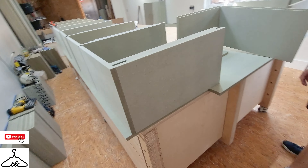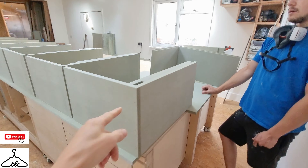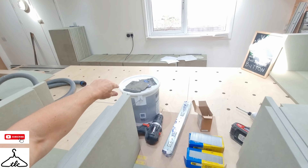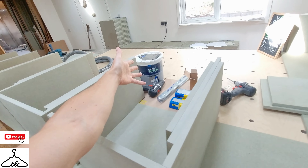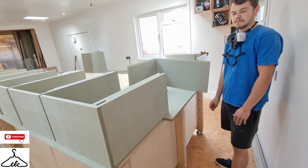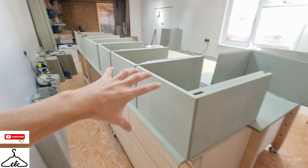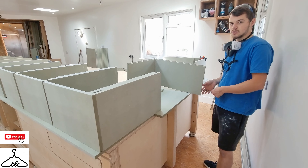Also, talk about the filling - because when you're making these drawers, when do you start filling all the holes? Effectively this is the side of the drawer. We've designed it so when the fascia goes on it covers the end grain and all you see is the pinholes. So we've got this jointing compound - we've been using this for a while when we treat MDF edges. It's a big tub of ready-mix filler - it's perfect. You'll be just filling the holes as you go. So you get all the corners done as a batch, then you do the last component, then you go around and do all the bottoms as a batch, then you fill them.